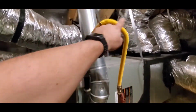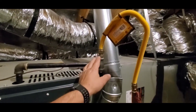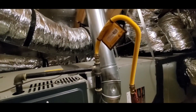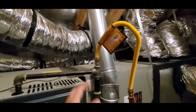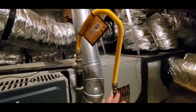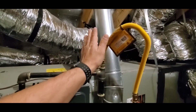What I like about this flexible gas connector is that it's smaller than six feet, which it should be. It's also fully visible — it doesn't go through concealed spaces, doesn't go through walls or floors. It's fully open and fully visible. If it ever needs to be replaced, it can easily be done: shut off the gas valve right here and replace the flexible gas connector. That is well done.